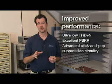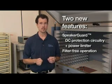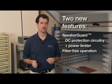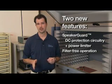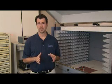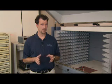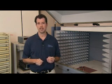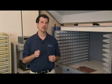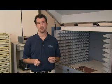In addition to this excellent performance, the 3110 has two very nice new features: speaker guard and filter-free operation. Speaker guard includes DC protection circuitry and a power limiter. The DC protection circuitry shuts the amp down any time a DC signal is detected on the inputs, which is typically due to something upstream of the amp failing. The variable power limiter limits the maximum output power, protecting the speakers from damage, and also allows multiple designs to share the same amplifier.